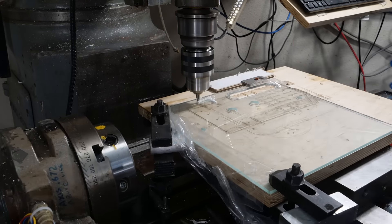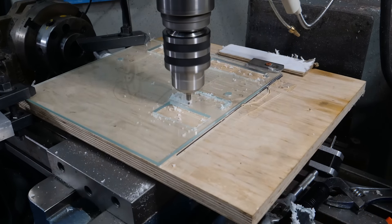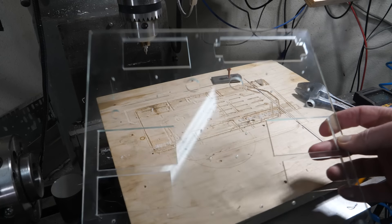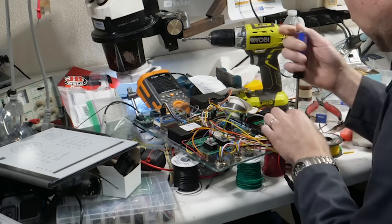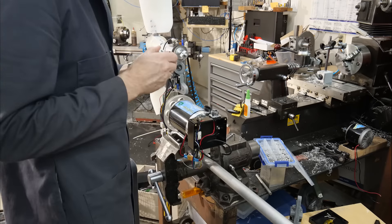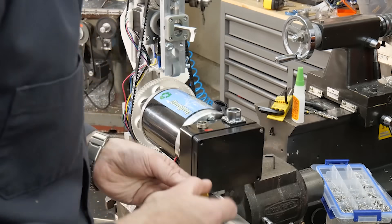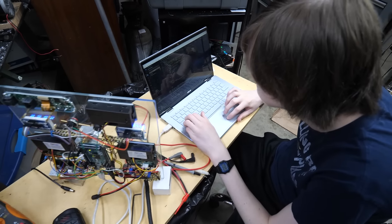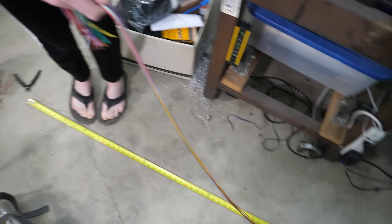The biggest change is the electronics. I'm tired of having two makeshift prototype panels, and including a second turbine is only going to make things worse. So I found a big piece of acrylic that should fit every display, gauge, and potentiometer we need. Routing the wiring and soldering the connections has to be done right or we risk burning something up. I'm also wiring one big control plug and one big power plug to a relay box on the back of each generator. With it all assembled, I can get my son Grant involved to program everything on a single Arduino, and he helped make the fancy cables we need to cleanly connect everything.